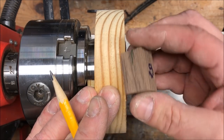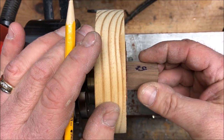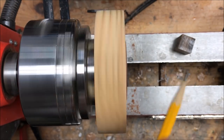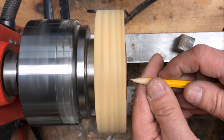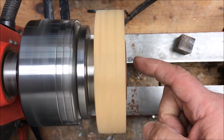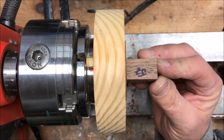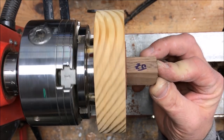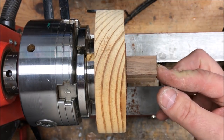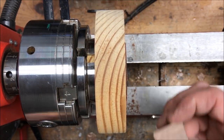I've got a small block of wood that we're going to turn the finial cap from and we need to make sure we get it centered on this sacrificial piece of wood. The way I like to do that is I'll turn the lathe on low speed, come in with a pencil, and put it at different points along the block of wood — it makes like a bullseye. That allows me to find the circle that most efficiently centers the block of wood. Once I know where that circle is, I'm ready to take my hot glue gun and glue this block of wood to the sacrificial block.